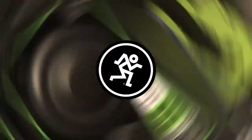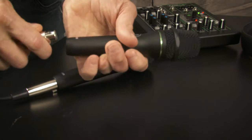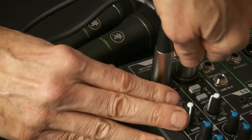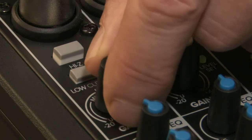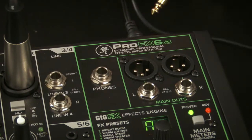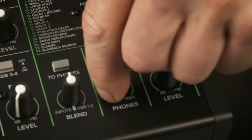Let's get started! First, connect the two EM89Ds to channels 1 and 2 on the Pro FX6v3 mixer. Set the gain control so that the level set LED for each channel lights up whenever your source hits its average volume level. For vocals, the low cut switch could help reduce the potential for nasty feedback. To hear yourself or anything else connected to the mixer, connect your new MC100 headphones to the phones jack. The level for this is controlled via the phones knob.